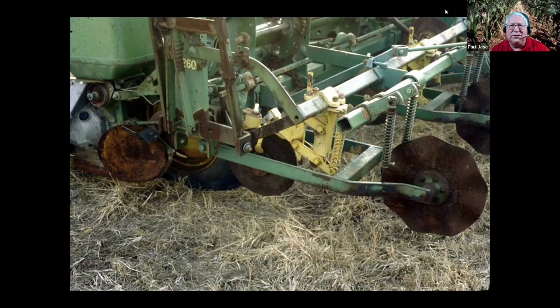Well, it tilled and loosened the soil. With that loosened soil, it's easy to get seed to soil contact. It was easy to close the seed V. I put tillage back in the system there, just not full width tillage. In fact, this is a newer planter. I use that word loosely.